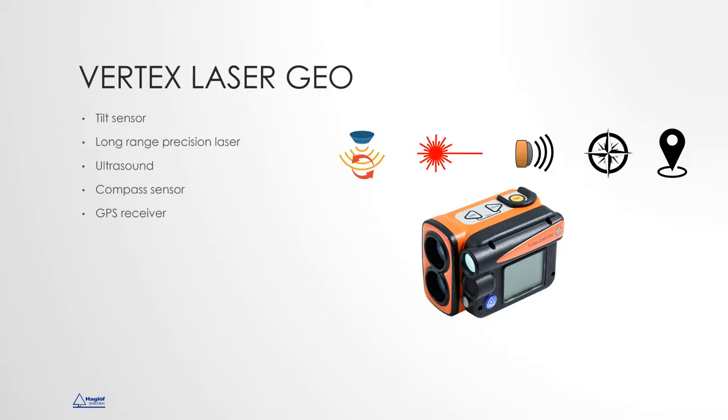There is also a possibility, if you need, maybe for a project you have a need for a very accurate position of your own position, then you can connect this unit, instead of the internal GPS, to a sub-meter GPS. For example, the Geode from Juniper is very good, that we tested a lot. But any Bluetooth GPS works.